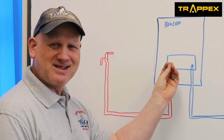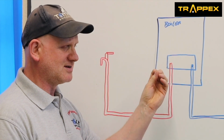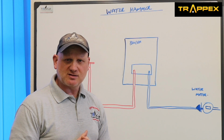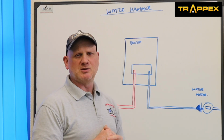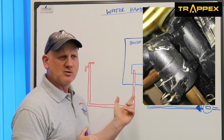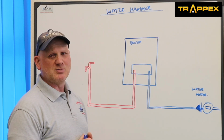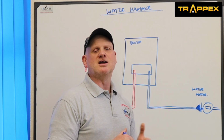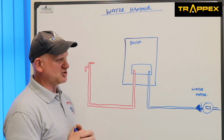So the plastic inside here is expanding and contracting, expanding and contracting. When it finds a weak point, it'll crack. I think a lot of us know about the problems Worcester have on the left-hand side hydroblock, where it always gets a pinhole and starts leaking. And they say that's mainly because there isn't any way of getting rid of the extra heat or the pressure.